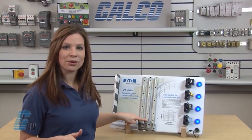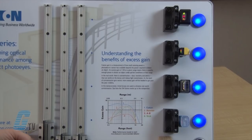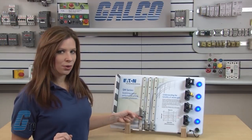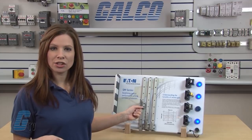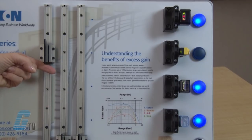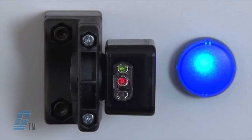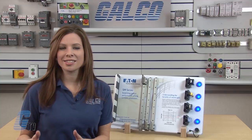I will bring this panel down and move on to the last one. This panel has 80% attenuation. Moving it up to the SICK unit, the light on the right has turned off — the contaminants have blocked the beam. Continuing to the Allen Bradley sensor, the attenuation has again blocked the light and the sensor is not able to properly function. The Banner unit is also unable to see through the panel. Now on the SM series, the light on the top has begun to flash a little quicker than before, signifying that the SM continues to operate even though the signal strength has dropped down to a gain of one to four times what is necessary to see the reflector target.